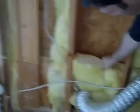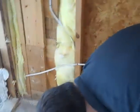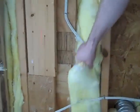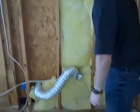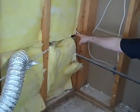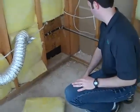This one wasn't too bad, but look at this — around trying to fit around this wiring, it's just a terrible install. Look at that huge void right there. And then when you've got beams or odd-shaped cavities, things just do not go very well. Look at this — just stuffed in there, did not get very good insulation value at all. Same thing with wire penetrations: where this wire was coming through, there's a huge void back in this corner here. Just really not a good install.